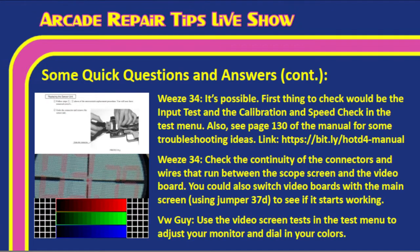Awesome. But if you go into the input test and you're not seeing the gun, or the trigger's not registering, or you go into the calibration and speed check and you don't see anything, then you may have a board issue like we talked about. Very possible, but let's try the test menu settings and some of those troubleshooting ideas from the manual first and see where we are after that.